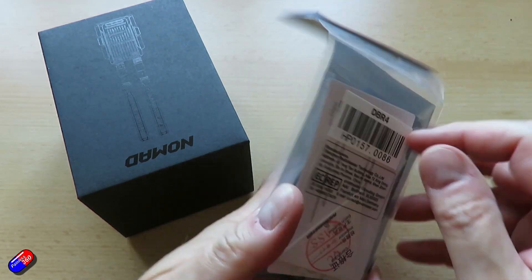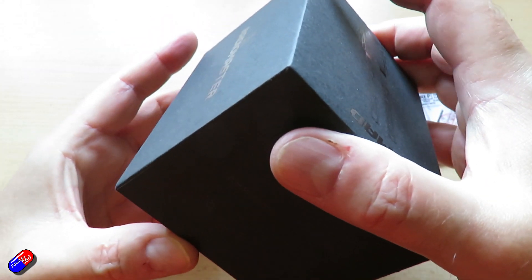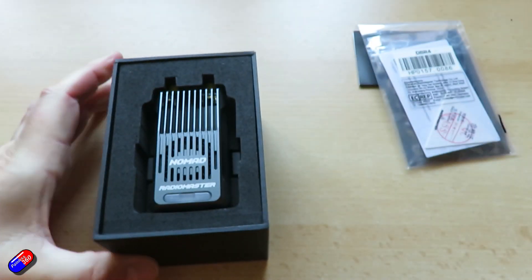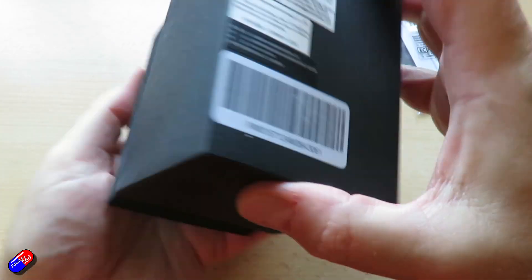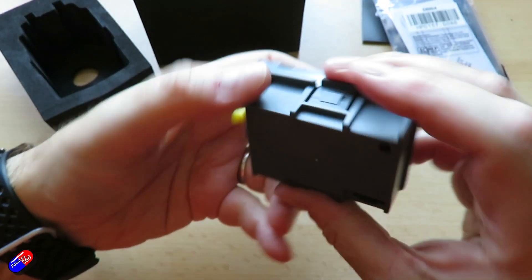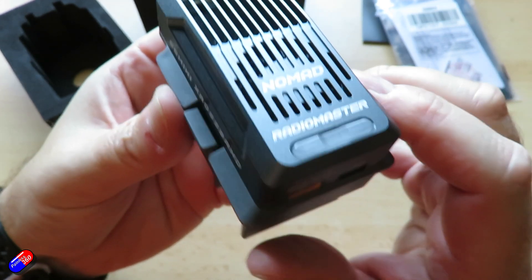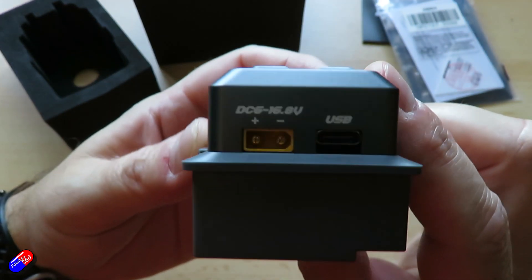This allows for both 2.4 GHz and 868/915 MHz frequencies using the Gemini crossband protocol. This is very much the open-source ExpressLRS equivalent to some of the TD stuff that FrSky has been doing for a while. It allows us to send packets on both bands simultaneously, which reduces the chance of packet loss and issues when flying in challenging conditions. Both transceivers are one watt, which should give really nice range for almost all pilots, and it also has new interference rejection technology.